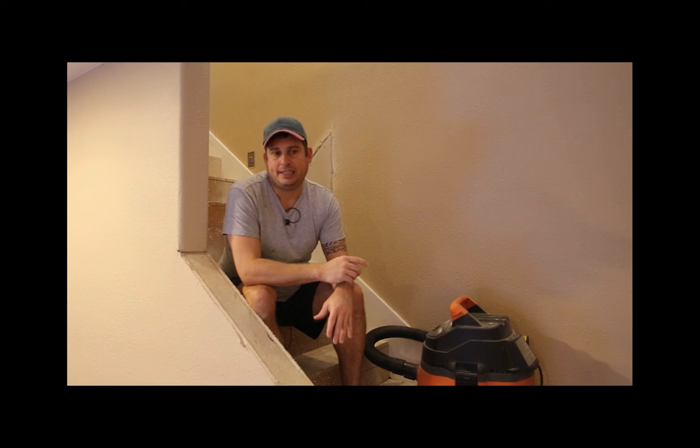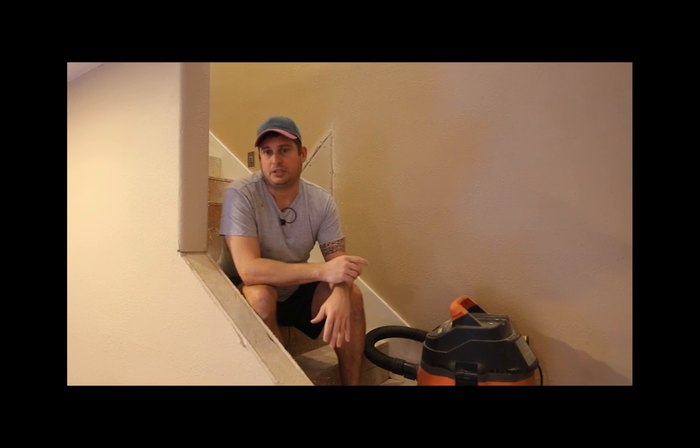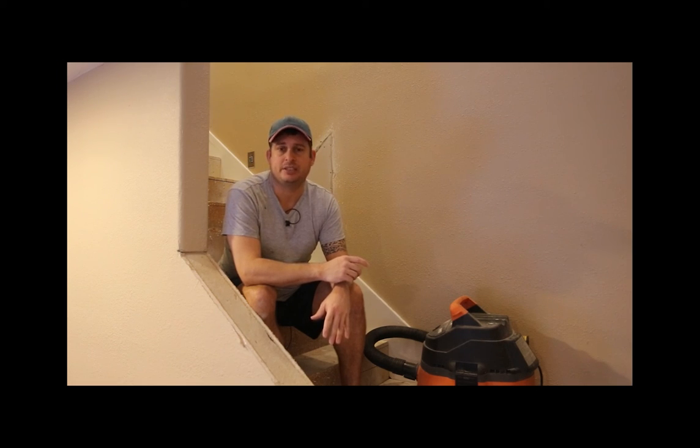I've got some other areas of the house I'm working on. And basically, when you mix up mud, the time from when you're done mixing until it starts to become unworkable is what that number is. With 20-minute mud, you really have 10 or 15 minutes to work with. With 45-minute mud, you've got about 30, 35 minutes. And with 90-minute mud, you've got a little over an hour, hour and 10 minutes. And that's just kind of how it is.